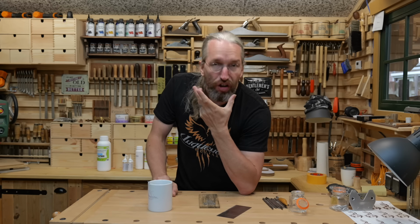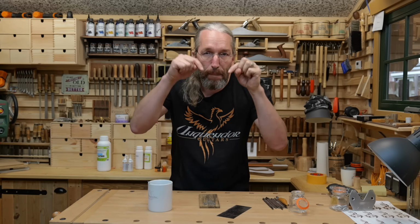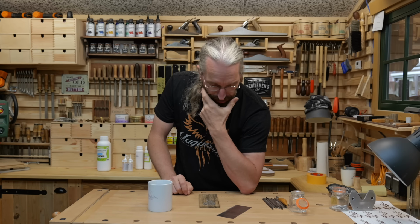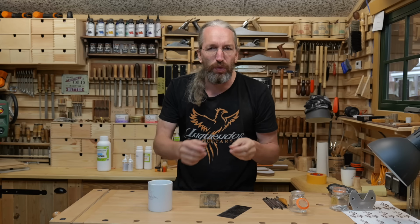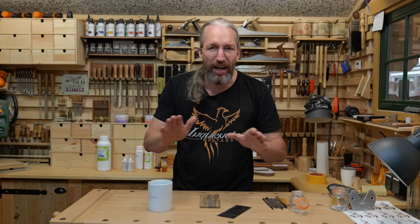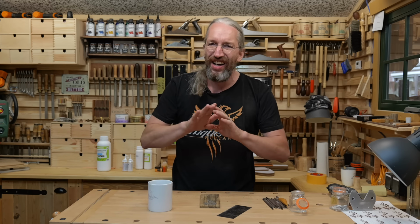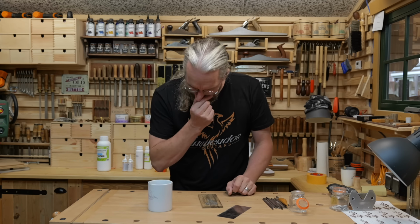The other method that was suggested in the comment section on the previous video was to first fill the cavity with resin and then push in the aluminium pieces. But I'm afraid when I'm going to do that, that it will get messy and I will lose track of where the cavity actually ends, because I'm fearing a puddle of epoxy resin everywhere, and then again the aluminium pieces might end up in slightly the wrong position.